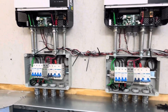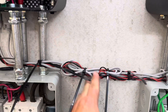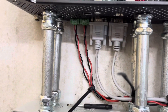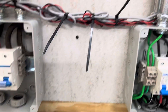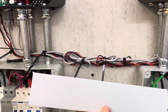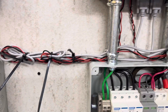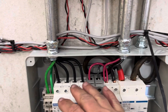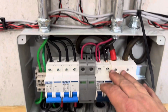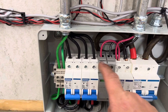Got a little more tidying up to do. All these special control wires here have connectors on them, so I wasn't able to put those in conduit, but I have some more wire duct that I'll be installing across here to tidy that up a little bit. All the top side of the inverter disconnect boxes are wired in, including the DC side.